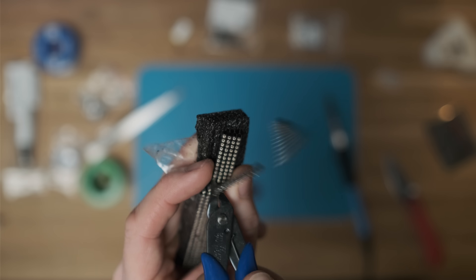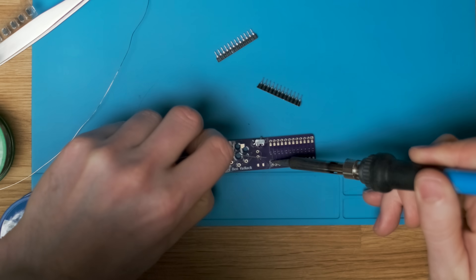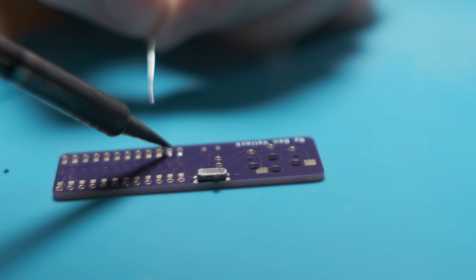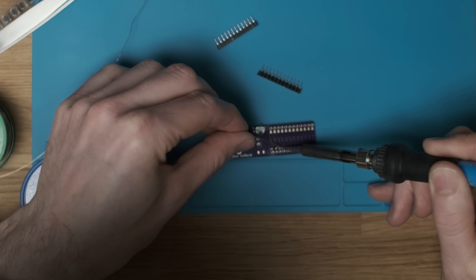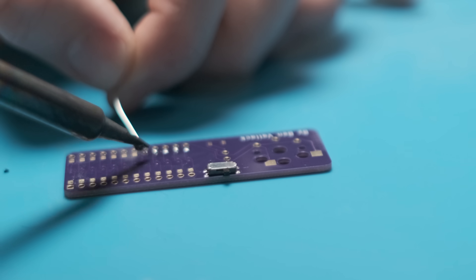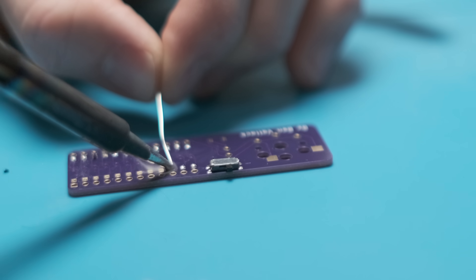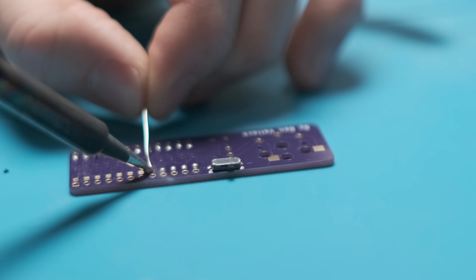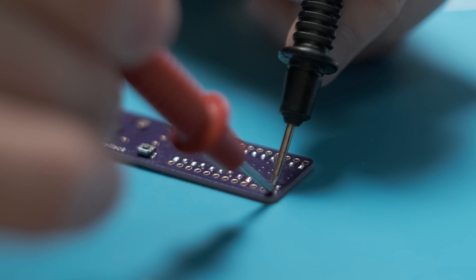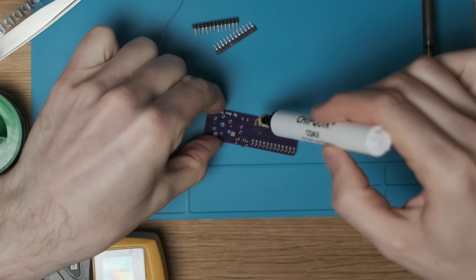I'm measuring up to see how many pins I need to snap off of the machine sockets, then adding some flux to the board and soldering these jumpers. This footprint on the board is a clever footprint that allows the Nice Nano controller to face up on both halves of a split board. If you want the controllers facing you on both halves, this footprint allows that by soldering together these jumpers on the face of the board that faces you. The Nice Nano will cover this side so you won't see the soldered jumpers, and the Nice Nano's logo will face you. I'm just testing the continuity of those jumpers — touching the back of the solder blob and the through hole to confirm it's connected.